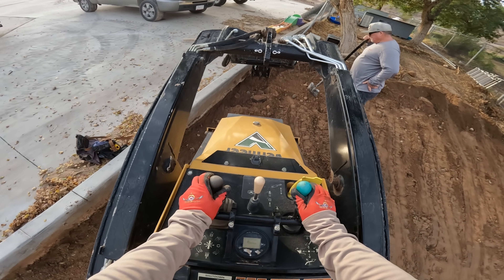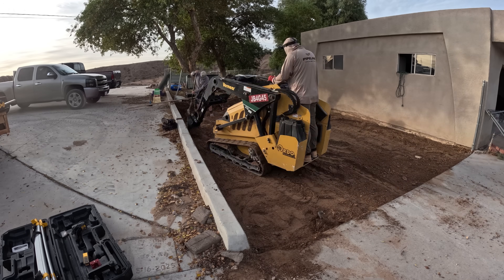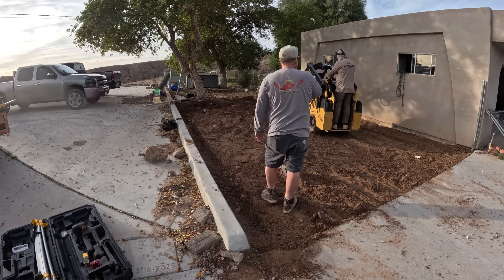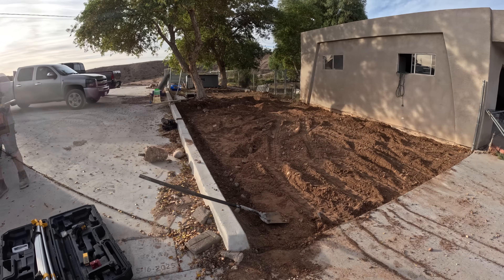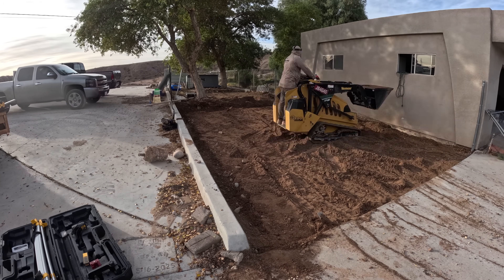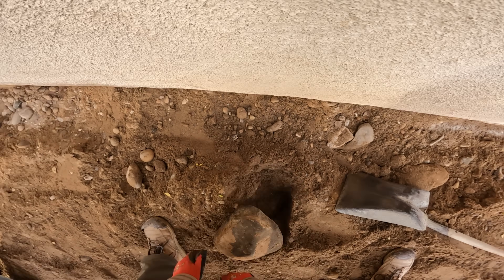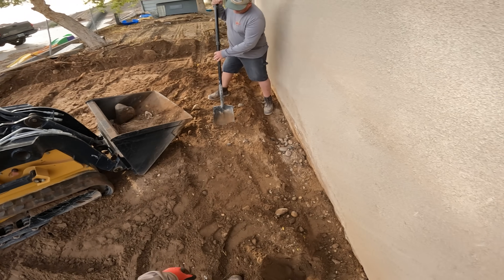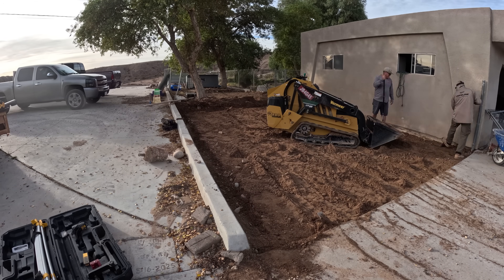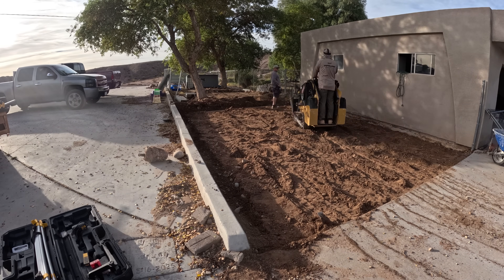We've dug out the dirt so far and now I'm just going to use the hoe attachment on the equipment. I'm going to scratch it out. I'm not going to do a really nice job digging because I have to go in on an angle — I don't have a swivel bucket or offset on the hoe. It's a basic piece of equipment that loosens up the dirt and helps you get it out a bit easier. I was dragging my one-foot bucket through there loosening up the rock so I could shovel it out. Could have been done by hand — just harder and more time.